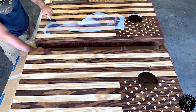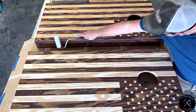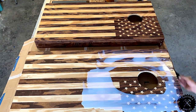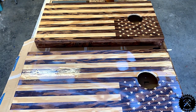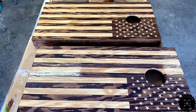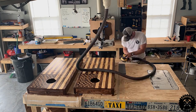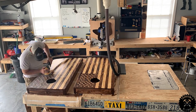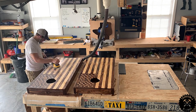Now we start to apply our clear coat. I'm using Minwax Pro Series Spar Urethane — this is a little bit better than your normal poly or polycrylic because it dries hard, fast, and becomes fully waterproof after 24 hours. Once the first coat dried, I used a piece of 220 grit sandpaper and a random orbital sander to knock down any of the rough edges and lines. You're not trying to remove the coat here, you're more or less just trying to smooth it down.